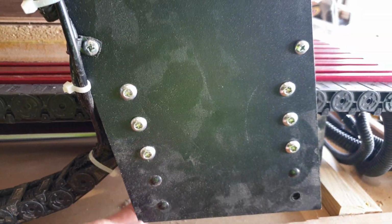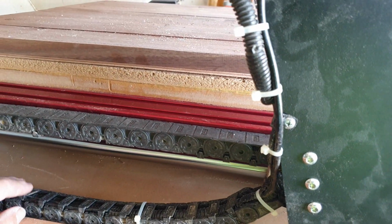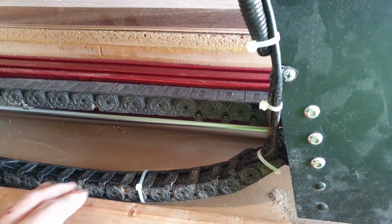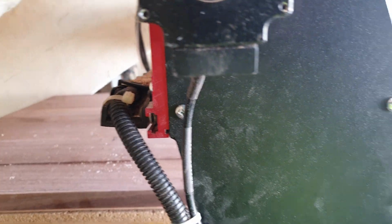I believe that it's probably, this cable is either open right here at this bend inside right here, or it was at this bend where it was working back and forth, because after many years in the communication industry, I learned that wherever there's a clamp or a bend point, that's where she's going to break. So not always, but most of the time. And so anyway, there's that.